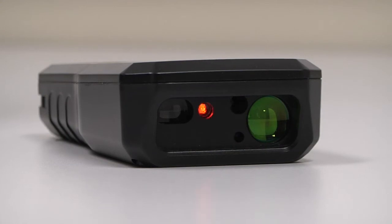During measurement, there are three separate lasers emitted from the instrument. The two visible lasers are the green laser and the red laser. The green is the spotter laser, showing where you are currently targeting. The red laser is the distance measurement. The IR laser that actually measures the gas is invisible.